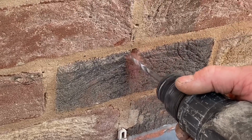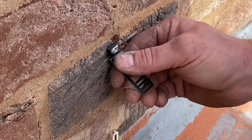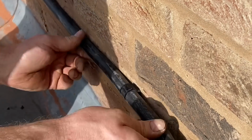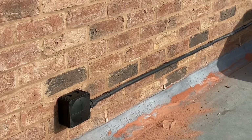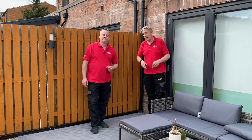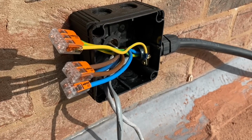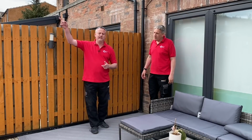So once we're onto the roof, obviously remember that roof's a challenge. It's a fiberglass roof, so we didn't want to fix to the roof itself. Certainly didn't want to drill through it and open up that wormhole of problems. So we've neatly clipped it around the parapet, where we get to a junction box where we're going to convert back to a 6mm twin and earth cable. In there, obviously, the armoured cable meets that twin and earth cable. We've also got the Cat 6 cable to continue the connectivity that we've allowed for at the EV charging point.